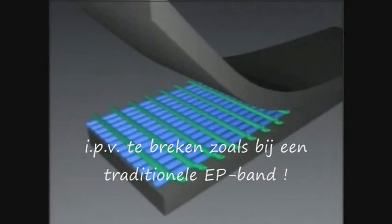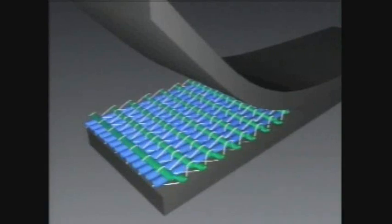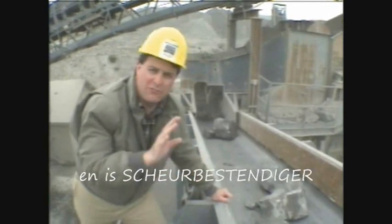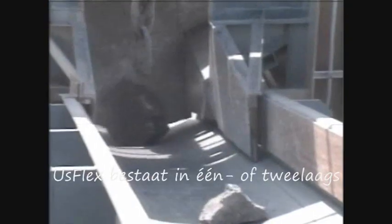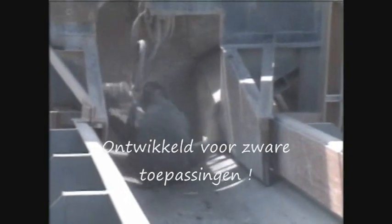There's another step in the unique USFLEX construction. A specially designed high-strength yarn runs over and under each crosswise strand, holding everything together. USFLEX is a carcass that absorbs impact and resists tearing far more than any other design available today. USFLEX belts come in either single or double carcasses with tension ratings up to 1,500 pounds PIW — a belt made to handle the most severe applications.